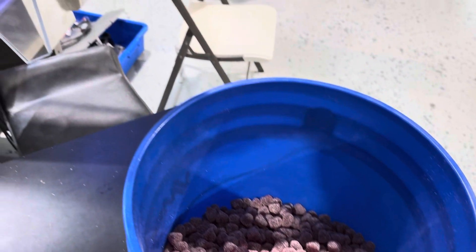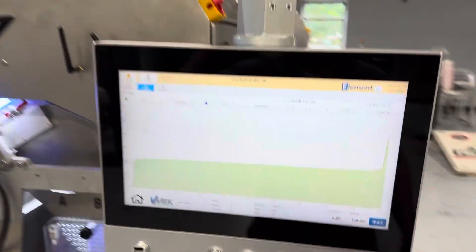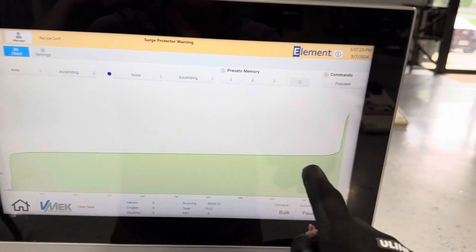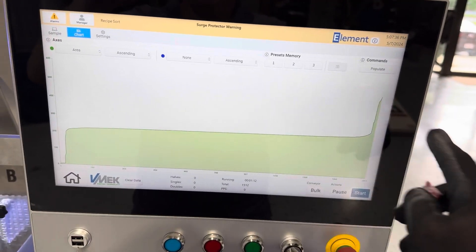We've already run the tare one time in this system and got the data. So this is a single chute. We've got the data on these parts, and you can see here there's the plot of the shape. So here we see those are the ones that are too small, and the ones that are too big are up here. So we can set parameters to keep everything in the middle and reject the outliers.